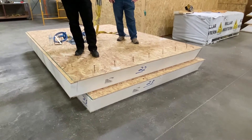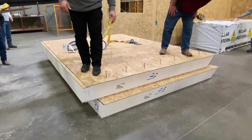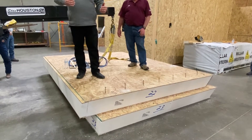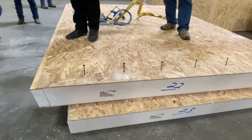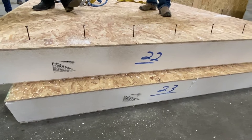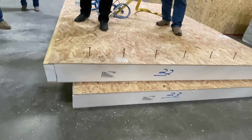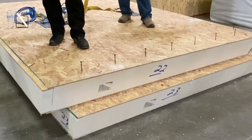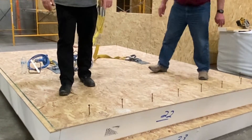You'll notice they snapped lines on these panels where the screws need to go. They figured out where a screw sits at the pitch of the roof — it's easy to do when it's laying flat, no pitch, perfectly square. Once you're up on the roof trying to keep that square it's much harder, so do it on the ground. Figure out how far from the ridge edge you need to be so the screw comes through and just catches the bottom OSB — not through the foam, not through the connecting spline, but in the center of the panel, 12 inches on center. They snapped the lines, started the screws, resting against the bottom OSB.